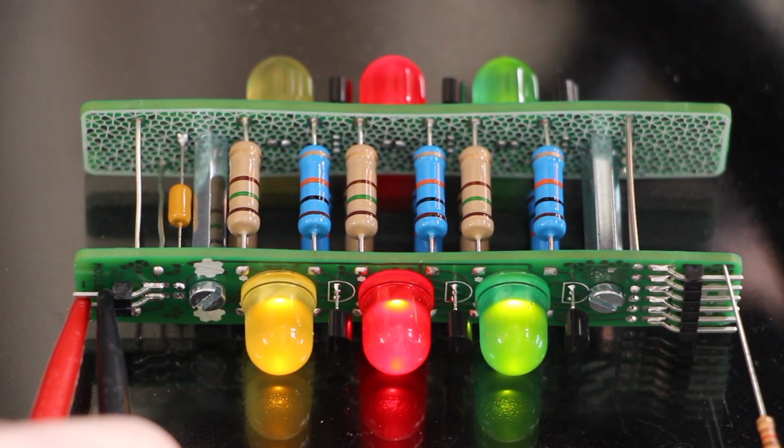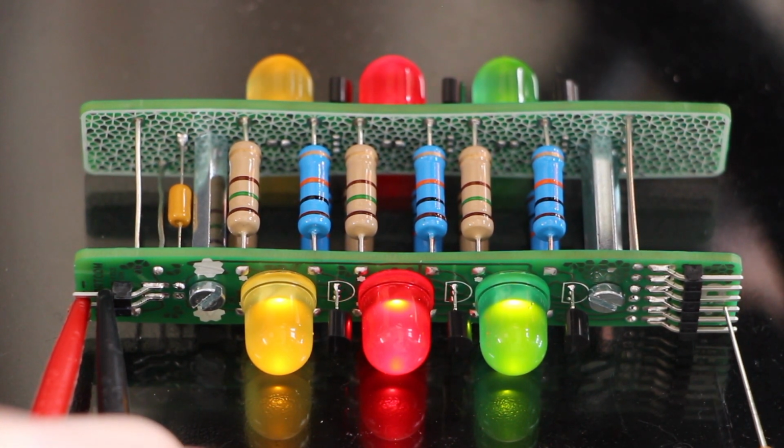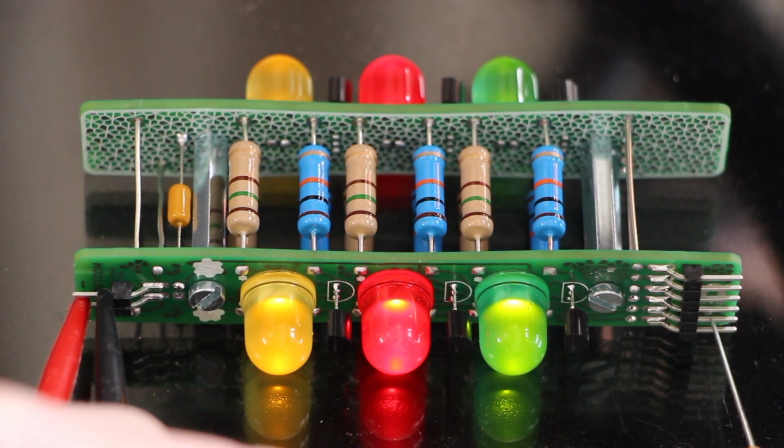The next trick this thing should be capable of is turning the LEDs on and off by grounding these inputs. Kind of verify that the impedance is about what we'd expect. We could try grounding them through a 100 ohm resistor. That's pretty fun. So these are all nice logic level inputs that we can hook up to other circuits when we feel like it.